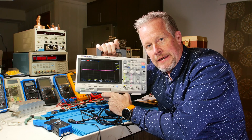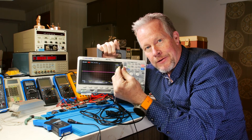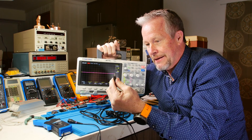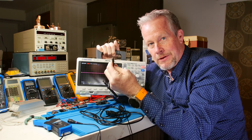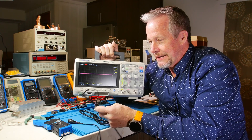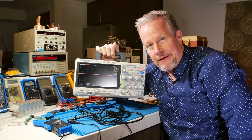For instance, troubleshooting AC power, and you just happen to — by accident — put this on something other than earth ground. Worst case scenario: maybe the 115 volt line coming in. And you happen to touch that. Well, now you've got a dead short with your power. And that would be a scary deal. Because that little wire is not meant to carry 15 amps, which your breaker is probably set for. So that would be scary.